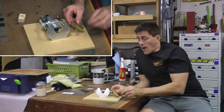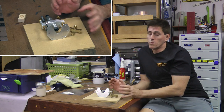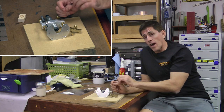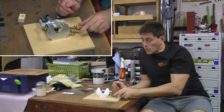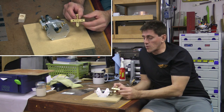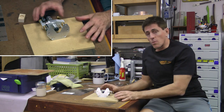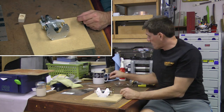The other problem is that you would have to guide the router exactly perpendicular to the tangent of the pattern. While it may not make a big difference if you're a little bit off, if you ever had to route twice that would be very, very important. Stuart MacDonald actually makes a lot of products for luthiers, and this accessory is used by guitar builders for doing inlays around the outer edge of the guitar body.